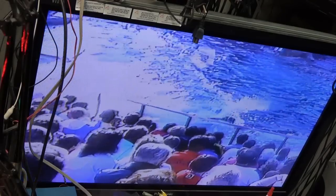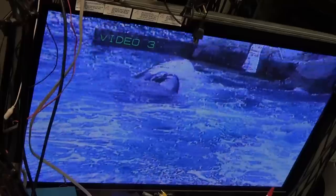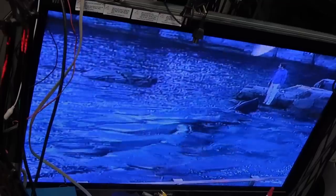Sometimes the dropout compensator will operate when playing back an old tape and cause some instability. There's not a lot you can do if the DOC kicks in, because it's based on the RF signal level coming off the tape. The heads are contaminated again — this tape is obviously losing its oxide coating and contaminating the heads. Normally you run the dropout compensator on.